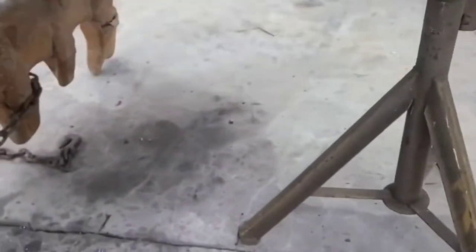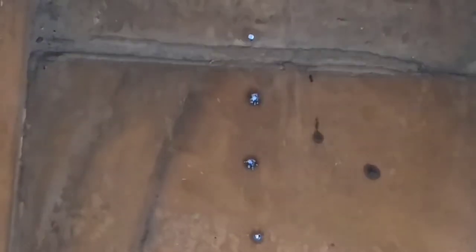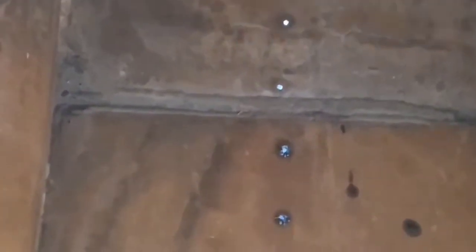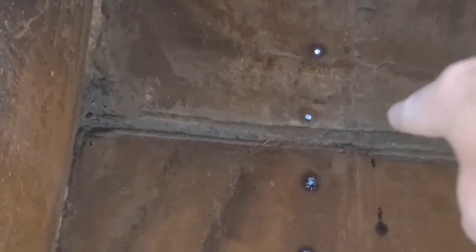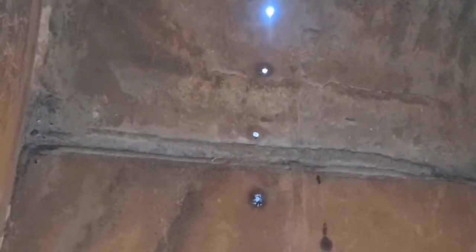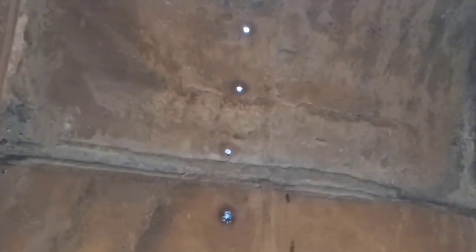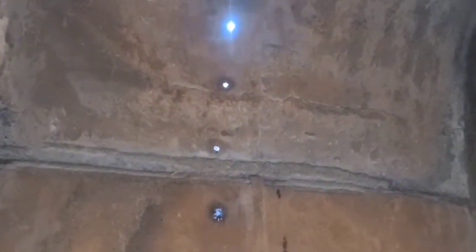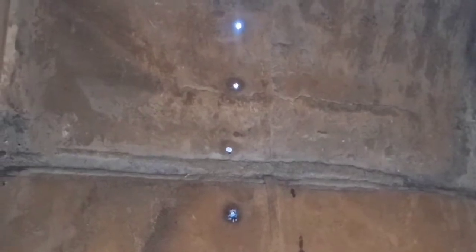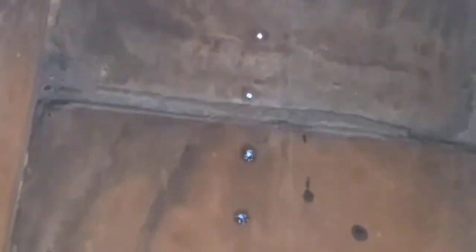But if you look inside, you see what I'm talking about. That area where there's already been a plate put in the bottom of the bucket. Right in this area above where it's been plated, where we've got a serious issue with it being thin, they've done a bunch of welding on it. And you can see a bunch of welding that's been done on the inside, and the shape of it's really rough. You can plate that, but it kind of makes a mess. I think it's quicker to cut it out. So we may be doing that.